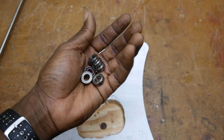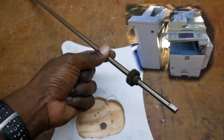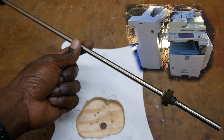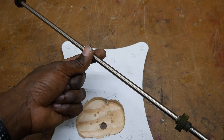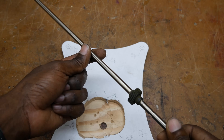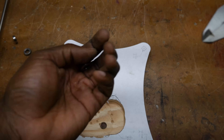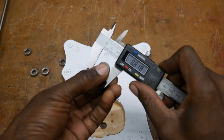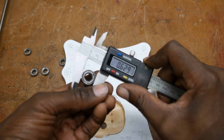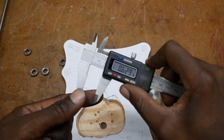I've got a whole bunch of these bearings after taking apart a massive commercial printer, and it fits this shafting which I also have a lot of now. There must be 30 or more of these inside that printer. I'm going to use this for my main drive shaft right through the middle of the clock. It's a 5/16 shaft, so approximately 8 millimeters. That's going to change the shape of that hole from what's in the plans, but if you're using the plans you can either purchase all the right material or modify and use what you have. I'll need a 5/8 bit and that'll leave me a nice press fit to get the bearing in there.